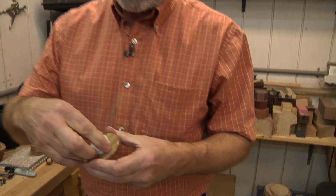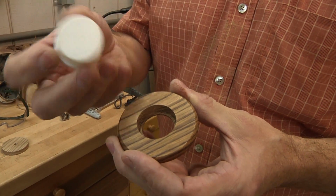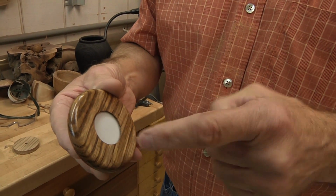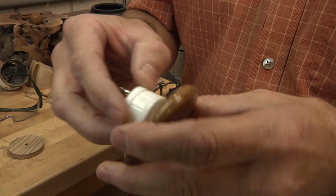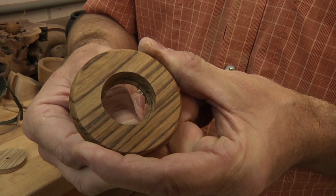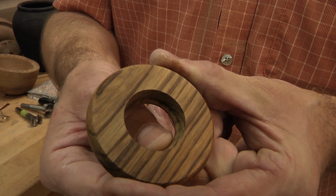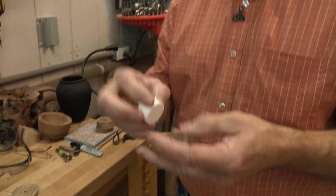But the way this is constructed is they tell you to drill a 1 3/16 inch hole for this to fit into, right? And then in their instructions, this is not opened up, and so you wind up cutting through it with a skew chisel, which was really tough on me. So we're going to drill a 1 3/16 inch hole here, and then we're going to drill a 1 inch hole through it so you get that little bitty lip. You can see that. We don't waste much of the light, and especially with the acrylic, it will shine through, so that doesn't matter. But I found out this is a real easy way to do this, because then later it's going to help us hold on the lathe without having to use double stick tape and a waste block and all that stuff.